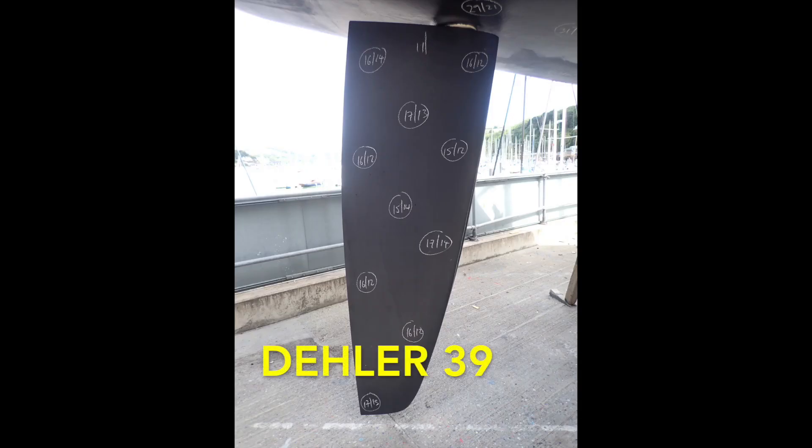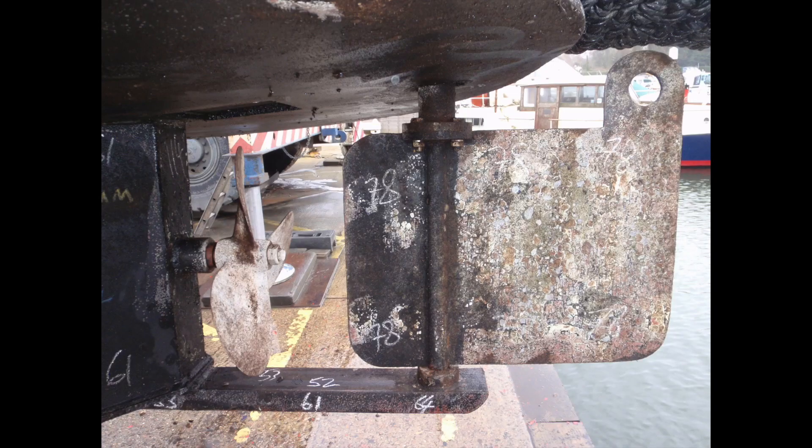Now it's time to get our hands on the rudder. Depending on the type of rudder fitted and its age, we can expect wear to occur in the structure of the rudder and its support bearings. We start off by checking for play in all three dimensions — longitudinal, lateral and vertical — and this requires us to physically manipulate the rudder in each of these planes. It's worth having some rag or gloves to minimise anti-foul rubbing off on your hands. As a general rule, if the play we find equals 10% of the rudder stock diameter, then remedial work should be recommended.